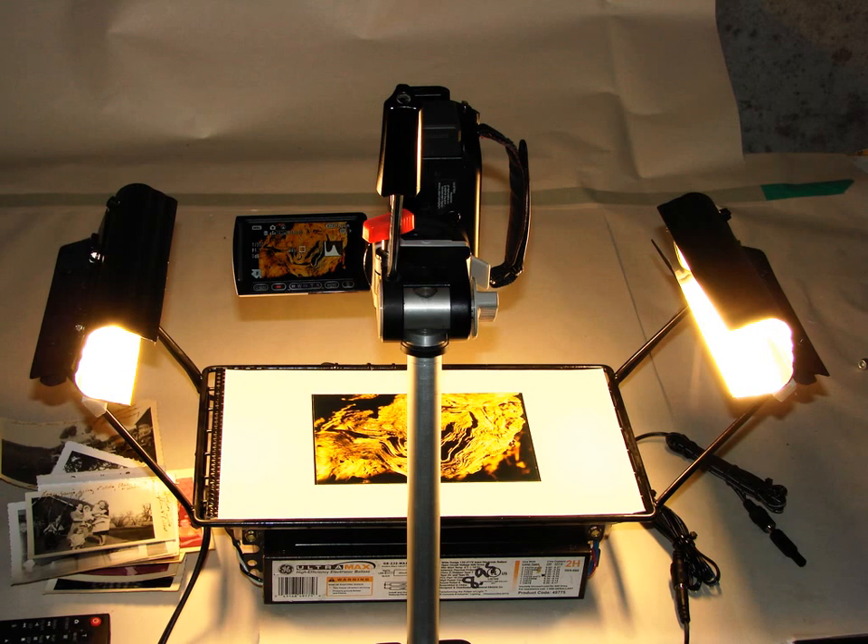Here's the finished product. I didn't use the battery-powered LED lights — instead I used 13-watt fluorescents in a piece of plastic rain gutter cut in half, painted black on the outside with aluminum foil tape on the inside. There's a fluorescent ballast on the front — $8.95 — that I had laying around, so that's why I used these lights. You can see all the cords arranged with the camera on the tripod and a preview on the camera. You set it up, turn the vacuum on, put your picture down, take your shot, pull the next picture up, put it down — it's just plop, plop, plop, take your picture. I hope that helps anyone who wants to build something like this; leave a comment if you need more information.